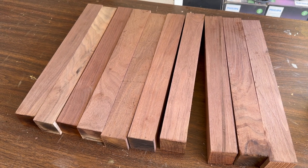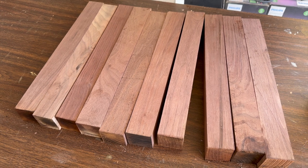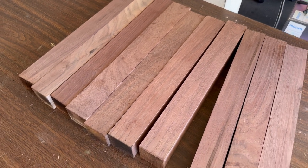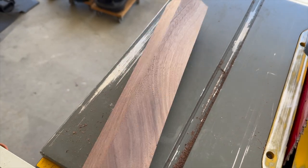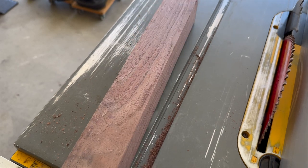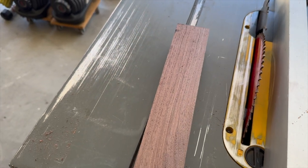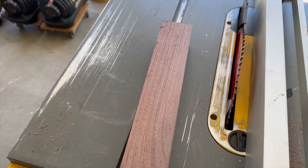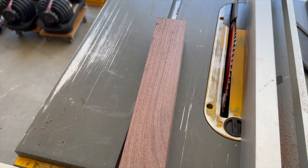I'm hoping I have enough because I'm only going to do the sides and the back — the front's going to be made out of reclaimed bourbon barrels. I made a cutting board recently out of that and the wood looks so amazing, I said I want to show that off on a speaker. You'll notice here there's a color change — this is the sapwood, which is a lighter color — so I'll cut it in a way that exposes more of the dark wood and hides the sapwood, because we'd like a uniform-looking piece of wood when it's done.